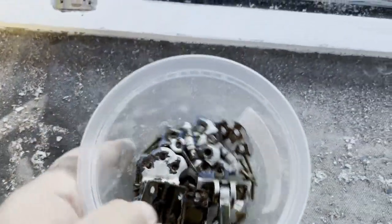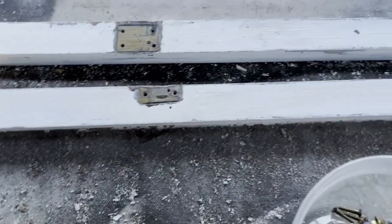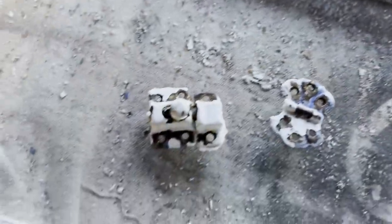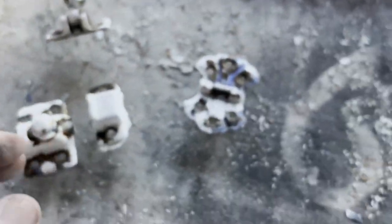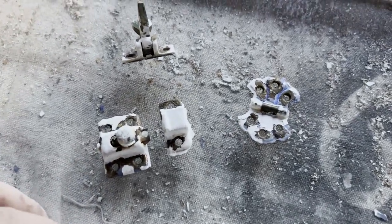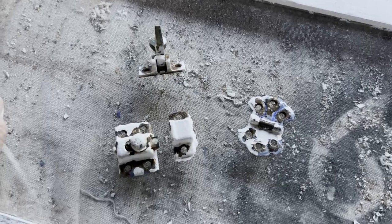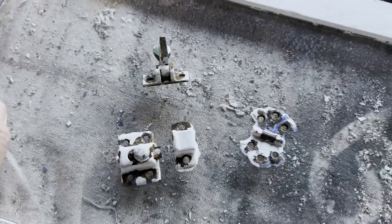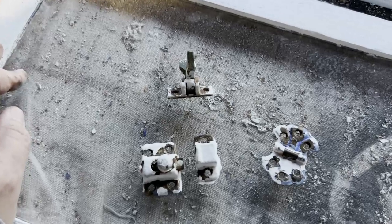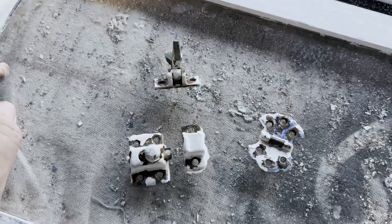Here is the bucket of hardware — everything that was on there: the hinges, the latch pieces, and another latch from the inside. This is all brass and it's all covered with a tremendous amount of paint, so it's going to need to soak. I learned a trick several years ago about using a crock pot. You put some water in the crock pot, put the brass hardware in, and just let it steep for an hour or so until it gets up to temperature. It will loosen the paint enough that it usually just falls or peels right off. So that'll be next.